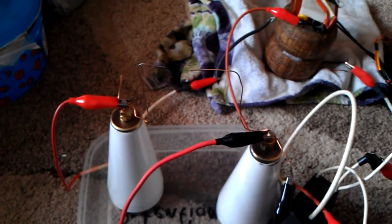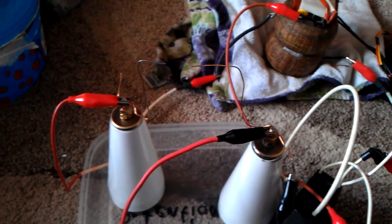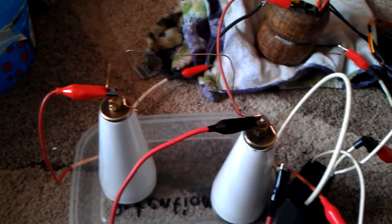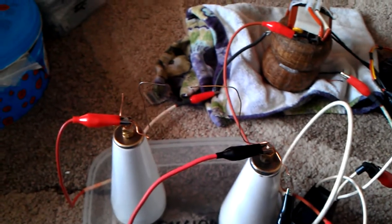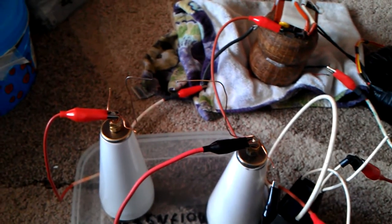It works, it does, but as soon as I turn the voltage any more than that, I can hear it inside — you can hear it arcing internally. So I've got to replace it with another 120KV transformer that I recently purchased off eBay.